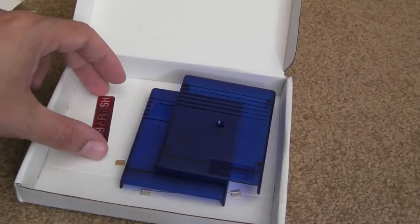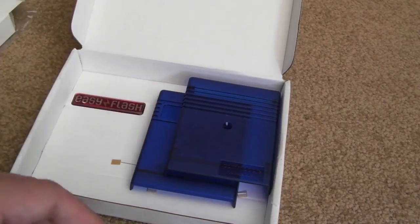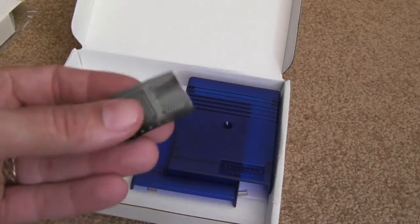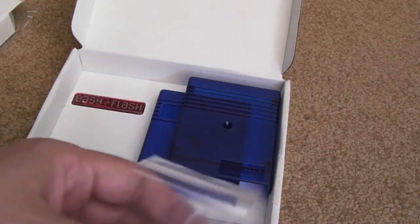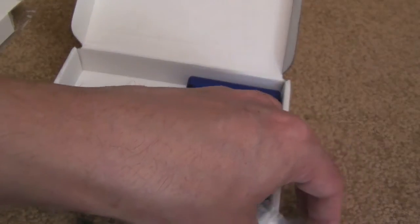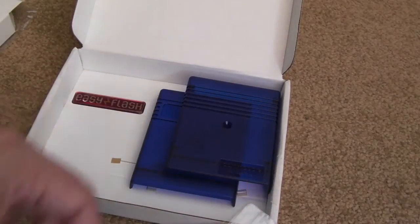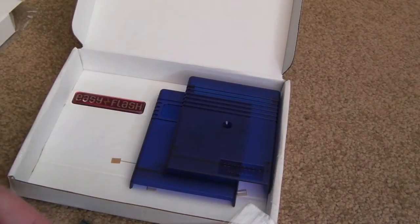And these are about £25, so they're a bit costly for what they are. You could probably buy a Commodore 64 for £25, but it's pretty powerful in the sense that you've got all of these different slots, and you can have different kernel revisions. So I'm thinking about putting something like JiffyDOS on there, so that floppy access is a bit faster. Anyway, I'll make a start on this now.